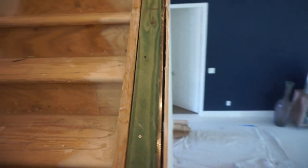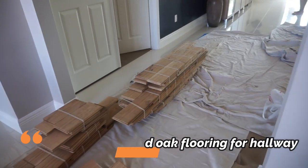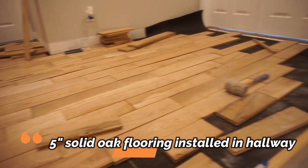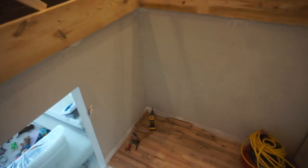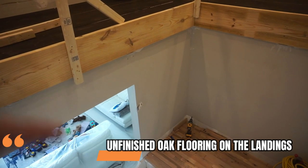That was a good first day. We got our landing in here, the wall that we built up here and rebuilt is no longer here anymore — this is all open. We are bringing in all the 5-inch flooring that we're going to be using on the second floor. We have our new stringers put in, and we're using a 2 and a quarter inch on the landing, which is exactly like the treads. I want the landing to look like one big tread.